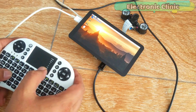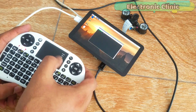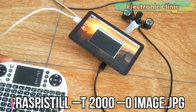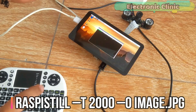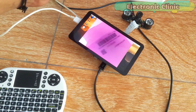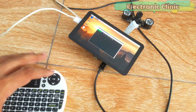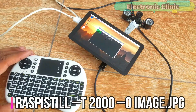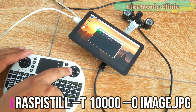To check the camera, open the terminal again. Write the command which you can see on the screen and press Enter. As you can see, the camera is working but it works only for two seconds. We can change the time — currently it's 2000, which is equal to two seconds. Let's make it 10000, which is equal to 10 seconds.